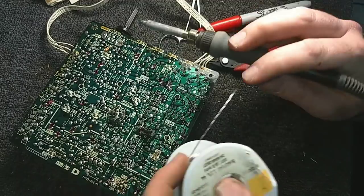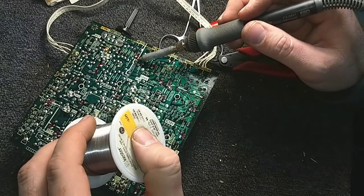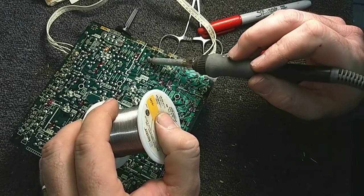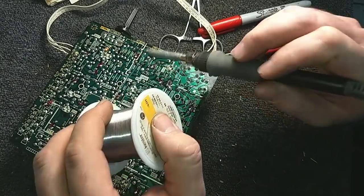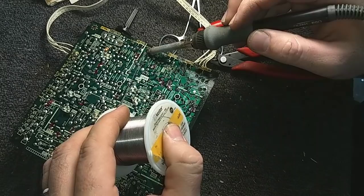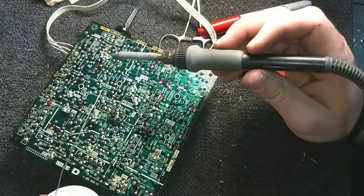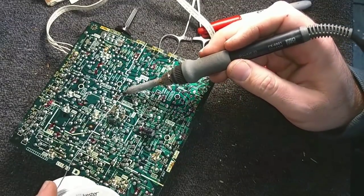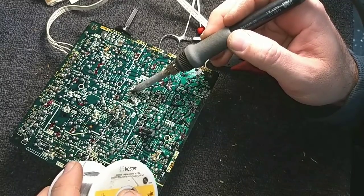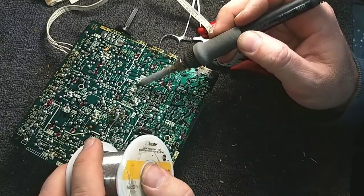Remember when I started getting into this hobby, discovering the bad horizontal AFC diodes, figuring out what to replace them with that actually worked, which varies from set to set. Although, time has told me that the little Schottky diodes in the TO220 packages, which are fairly fast recovery, work pretty well.